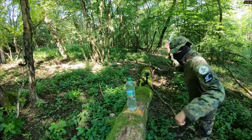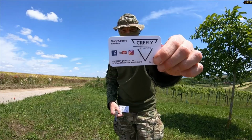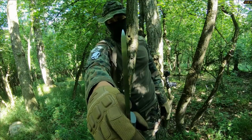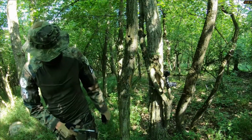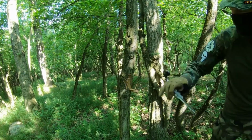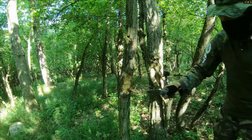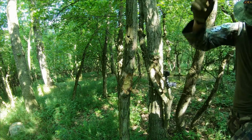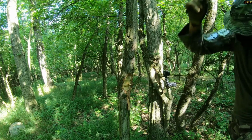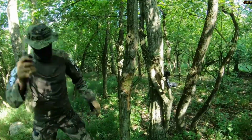I used 1/4 inch stock. I ground a convex, kind of what I would call a Scandivex edge on it. And I heat treated it, looking at Larrin Thomas's chart on 8670, at about 58 Rockwell, because that is where it seemed to have the highest level of toughness for this particular steel. So this steel is very tough. It is not very high edge holding. It has hardly any corrosion resistance, maybe a little more than a 1095 or a 52100, but not a lot.